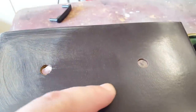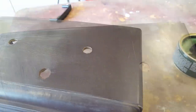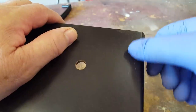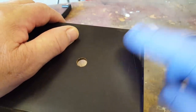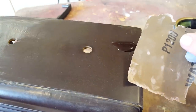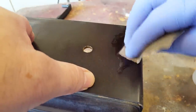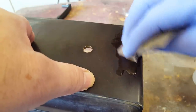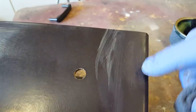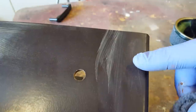After about 45 seconds, let's see if it'll come off. It's better, but it's not fantastic. I really think this is a poor casting of the bakelite. There's a little scratch I was hoping would buff out, but it hasn't. So I'm going to sand it with a bit of very fine P1200 wet and dry, polish it up again, and hopefully get rid of that. But I don't want to go too far in case I go through the crust of the bakelite into the stock inside. I'm going to live with that.